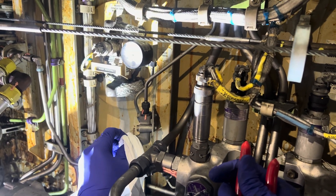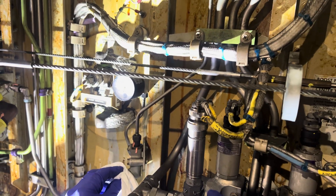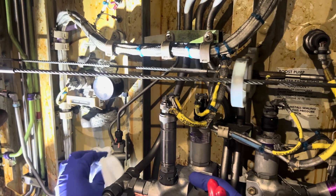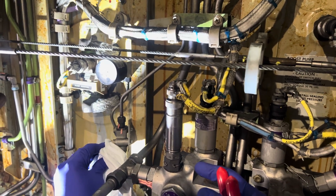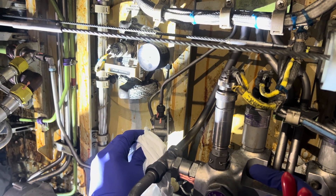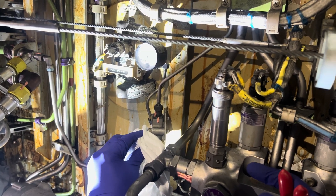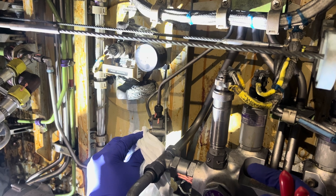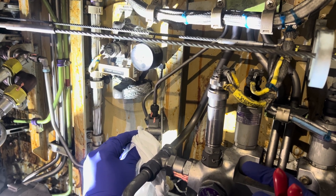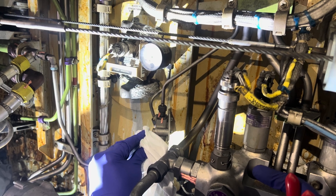The air pressure is going to be depressurizing. It's really hard to see right now because the brightness is a little high, but you can actually hear the air coming out in the video. One of the precautions you've got to be aware of is there's always a tendency for hydraulic fluid to come out as the air comes out. I'm telling you from personal experience because I've had that spill on me before. So yeah, that's a little precaution. It's a pretty easy task and hopefully you guys enjoy this.